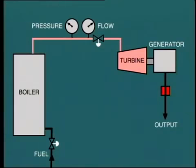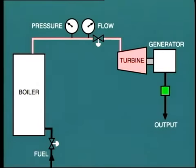Now, in addition to problems caused by high temperature, we can also damage boiler tubes and components by excessive high pressure. But what could cause such a rise in steam pressure? Well, just imagine what happens when the boiler suffers a load rejection. That is, the steam turbine or other downstream equipment suddenly decreases load. In this case, the boiler is suddenly left with minimal steam flow output and a large heat input still entering the boiler. The result is an immediate increase in steam pressure.